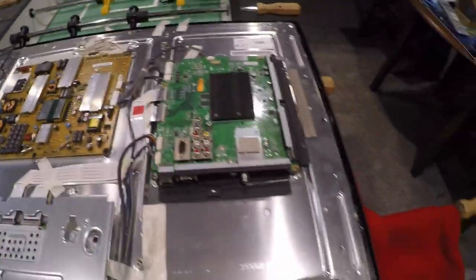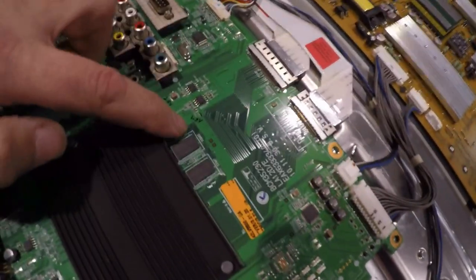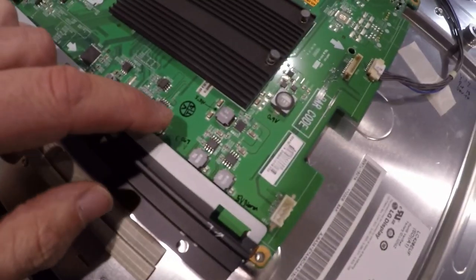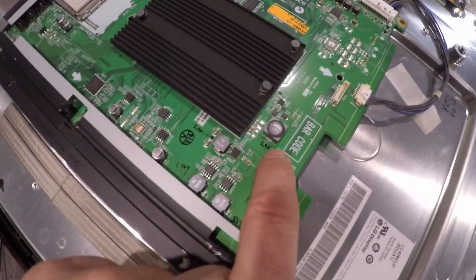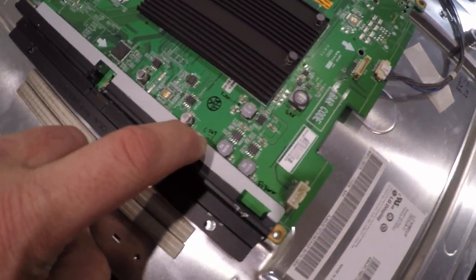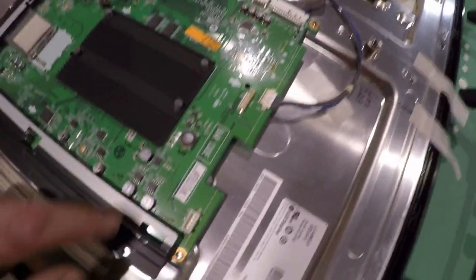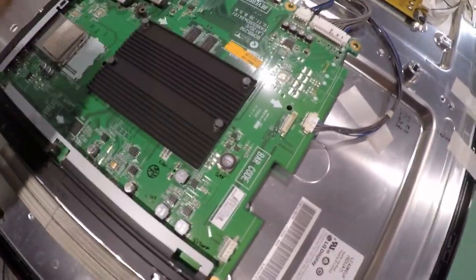So that kind of left something wrong with the main board. There's a bunch of local power supplies: over here is a 1.5 volt, a 2.5 volt supply, a 3.3 volt they call it normal, a 0.9 volt supply, a 5 volt normal, and another 5 volt supply. And all those supplies were active. I've had bad caps on other devices go bad, but everything was working.